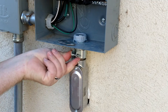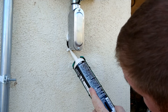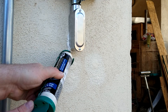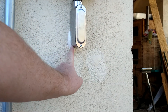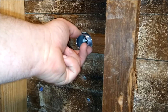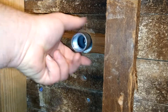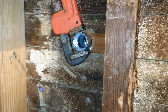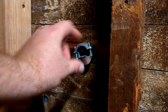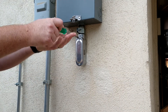I then installed the bolt and tightened the clamp to make sure nothing can move, and applied sealant to the rest of the hole. On the other side of the wall, I attached the close nipple and a female coupling. A one inch cable clamp will provide strain relief — it's going to be upside down because that's how things lined up. After removing the cover from this fitting, I'm ready to run my wire.